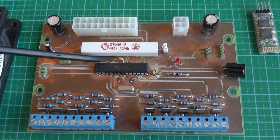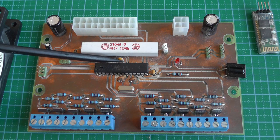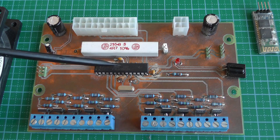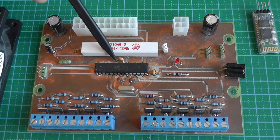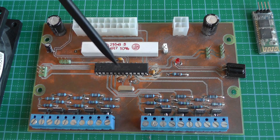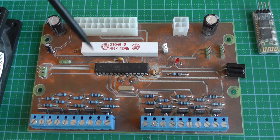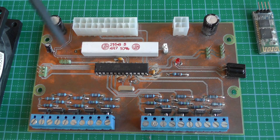There's also an onboard temperature sensor — the ATmega328P has an internal voltage sensor I use for temperature monitoring. If the board temperature exceeds 60°C, the microcontroller switches off the power supply to prevent damage. It's not perfectly accurate since it measures the microcontroller's internal temperature, but it gives a good indication of what's happening near the power resistor.